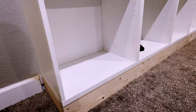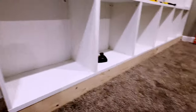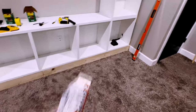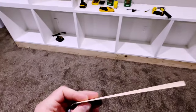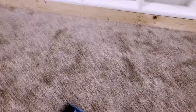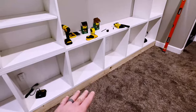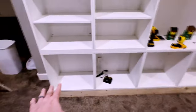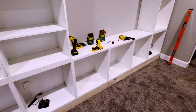The thing with the poured concrete slabs here, they're not level at all. So I spent a good amount of time using these guys, shims, to try to bring it all up to level, and that is infuriating. If you have any kind of leaning towards OCD, you'll go crazy because you will get it level over here, and then you'll go over here and start shimming that to level that up, which will then throw off the leveling there. So yeah, it drove me a little nuts. If anybody has tips for doing that better, leave comments.